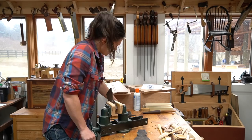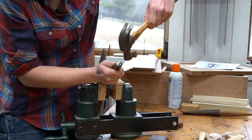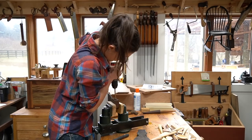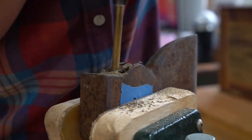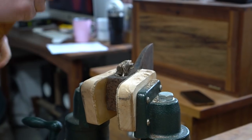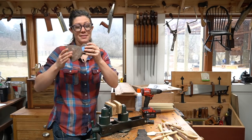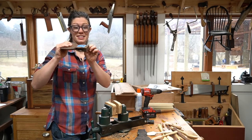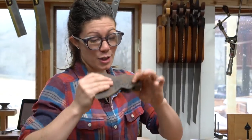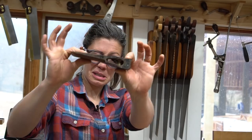We'll start with a homemade tool — just a little punch to hopefully get that wood out. Someone's grandpa sometime did a really nifty fix on their axe to re-handle it, and they put these two metal wedges in there which really don't want to come out, but we've got that little guy there.